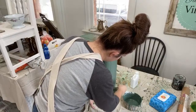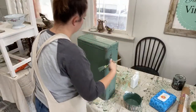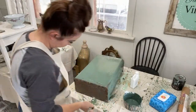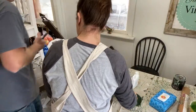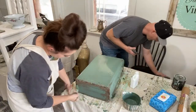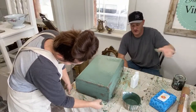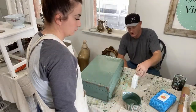I did film them doing some of the site prep and digging. It basically looks like we have a huge swimming pool where the addition is going to go, because we're doing a crawl space down there underneath instead of a slab on grade foundation. And we did that because we had to raise it up quite a bit because we wanted the addition to be on the same level as the old part of the house. So the new addition will be level with that.